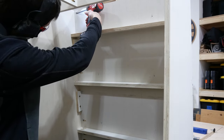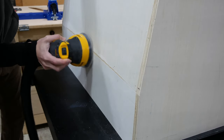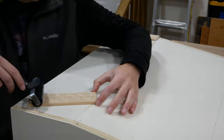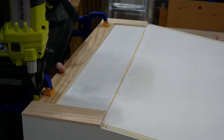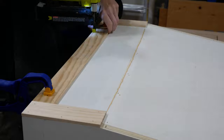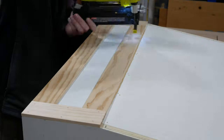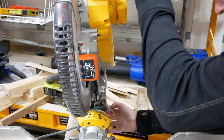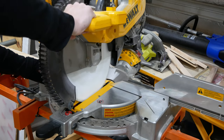I'm just about ready to add trim to the cabinet but first I sanded where the front panel meets the cross piece below since they didn't quite line up as well as I wanted. To trim out the front of the range hood cabinet I started with 2-1/4 inch wide by 1/4 inch thick trim pieces. I spread wood glue on the back using a brayer roller and tacked them in place with brads. The ends of the pieces that go on the front angle part don't sit flush against the trim below, so I took those to the miter saw, set the saw to that same 8.5 degree bevel, and cut one end of the trim.